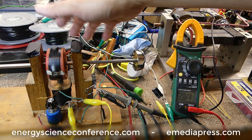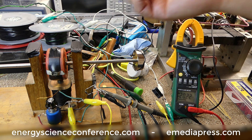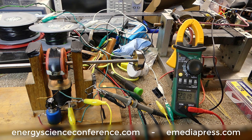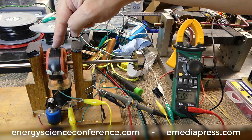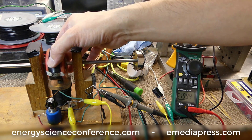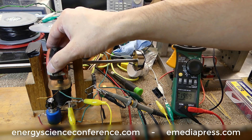What we're actually doing is using Lenz's law to our advantage. When current is induced and the coil is shorted, it creates a counter current — Lenz's law — producing an opposing magnetic field that counters the magnet. This is essentially the same thing a piece of silver or copper does to a spinning magnet through eddy currents. That opposing field neutralizes the attraction between magnet and core, so it can pull away quicker, giving you higher RPM and reduced drag.